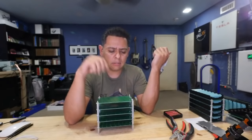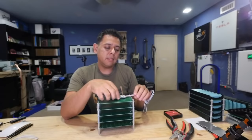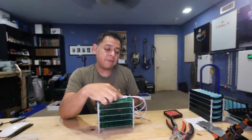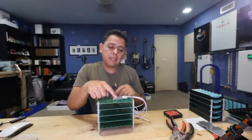So anyways, I thought if we make a board where the BMS goes on there, right? Like a unit where, here are the 8 pins. All we have to do is put a little connector in there, and then you put it on here, and then connect that. If I design it correctly, then the trace comes right up to that pad, and then another trace comes up to that pad, and you just solder.